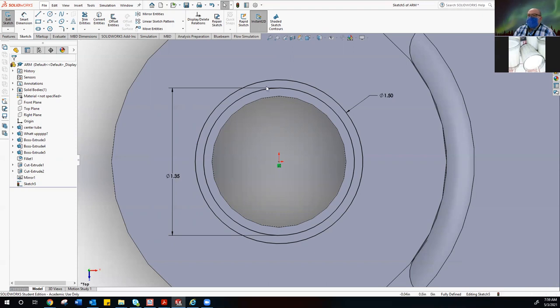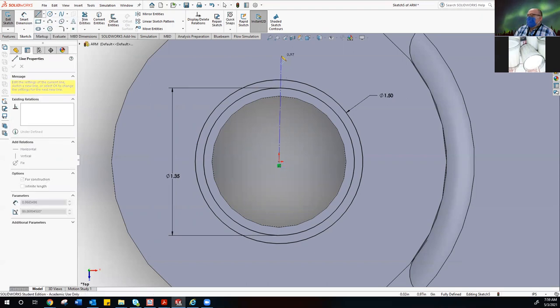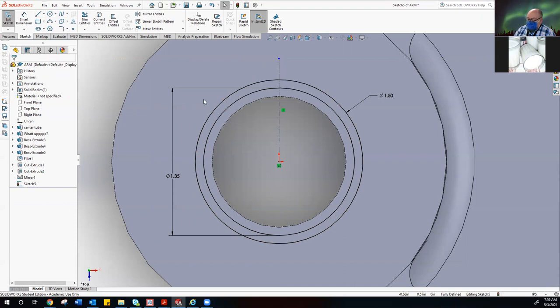We're going to start with one gear tooth in the top quadrant of our circle, and we'll lay it out with construction lines. Go to Line > Center Line, start from the origin and go up through your outer diameter. Just take it up — don't go crazy, just get above the line. That centerline is kind of important on this one.